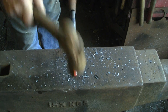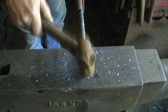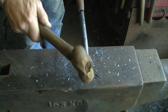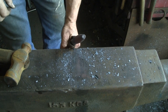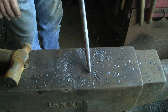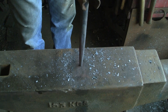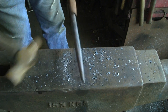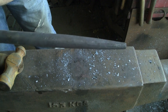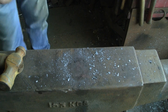Just got it warm - knock it back, that's all it takes. Then just round it off again. You can do this and get a nice finish and never have to put a rasp or grinder on it. Look at that - nice result. And then this is the secret bit: just give it one good bash, that's it. Just one good bash when it's nearly cold - that's just flared it out enough. You can hardly see it, but it's just enough so that when you punch, it doesn't bind; it eases its way through the steel.